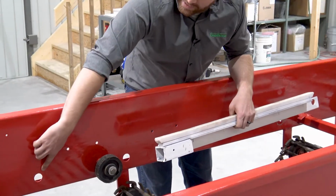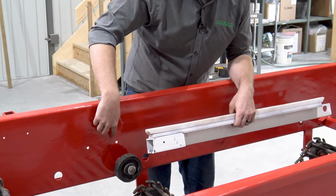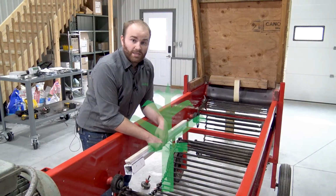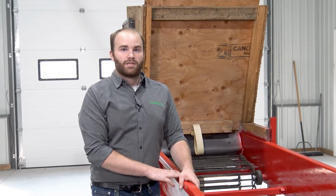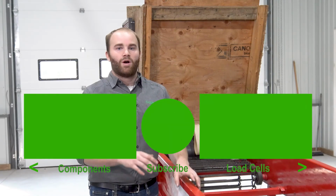The second way we did it was the exact same way. We took a drill and made two holes for the load cell bracket. We widened the hole for a roller, but instead of the slider, we are going to mount a roller to the load cell. So now your conveyor should be prepped for mounting the load cells and the other various components. So in the next video, we're going to show you exactly how to do that and the things to watch out for while you're doing it.